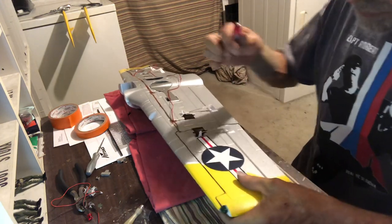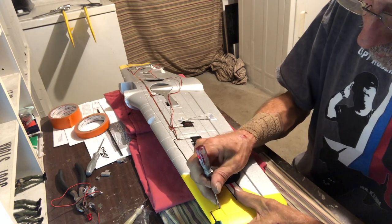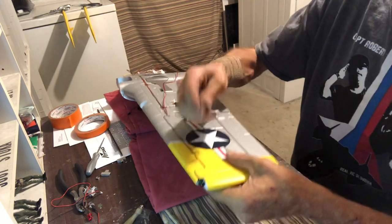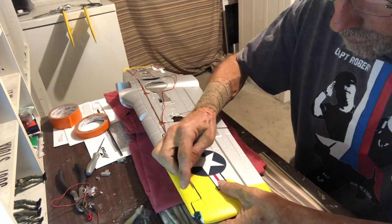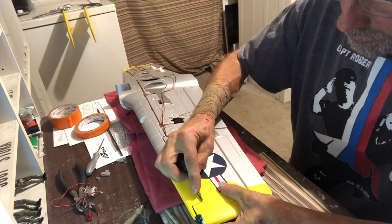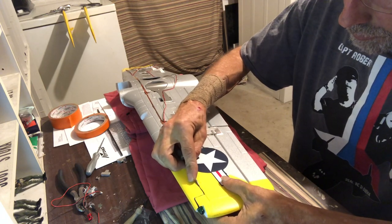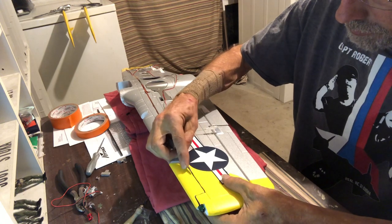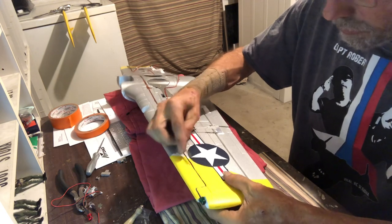You take that same screwdriver and the only thing you gotta worry about is the turns, really. Get them turns in there. Once you get them turns started, you use the same process you did with opening the valley. You hold that screwdriver at a 45 degree angle, or maybe less, maybe a 30 degree angle, and you just sit there and push that wire down in there. And once you get it going, if you've got your lead run down right, nice smooth and in the channel, that screwdriver, push that lead right down in.